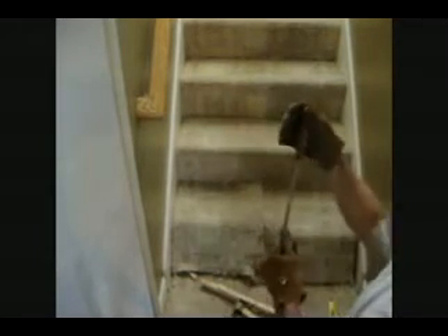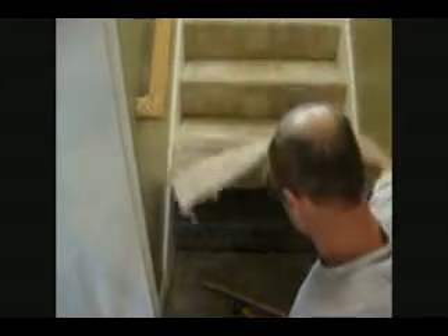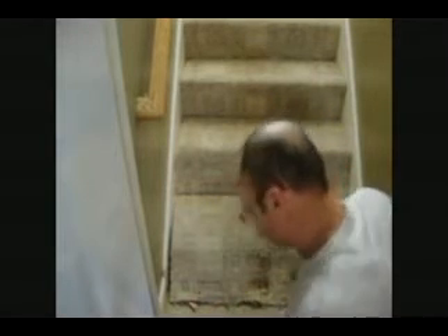I cut right through this carpet so I can grab down in here with the screwdriver. I bent it over the screwdriver to start it — the long bladed screwdriver. All I want to do is lift this up, and then once I've got something to get a hold of, I just pull and my carpet comes out piece by piece. What I also did is set up a box to put this in — this stuff is nasty, it's got nails all through it. I don't want to be stepping on it or running into it later. So I'm going to simply pull this whole piece of carpet right off the steps.